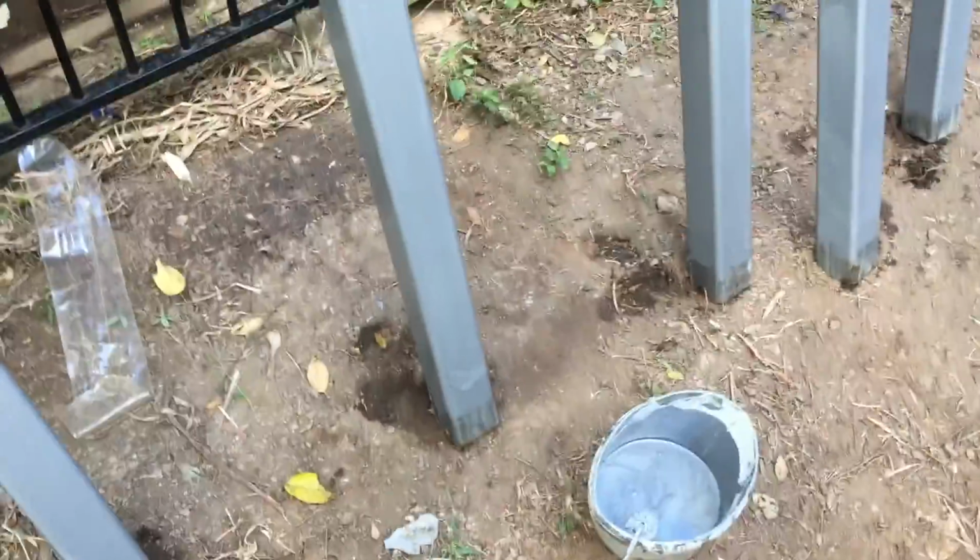So you're painting them about 4 feet high, at 1200, to get the epoxy coat. Once again, two-pack epoxy. It's the Interplus 1180 from International Paints, and yeah, it's an excellent paint.